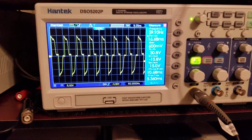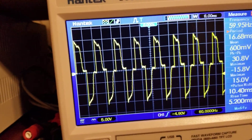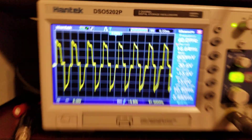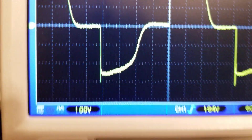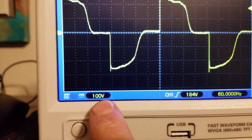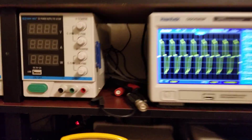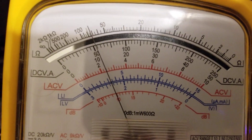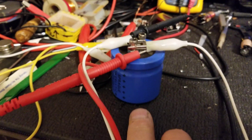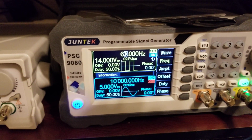This is the input on the tickler coil — the driving coil — which is right here. That's my output. On the 100 volt scale now, but we're looking at the AC side of the bridge, not the DC side. We're at 51 volts on this cap. 60 hertz, square wave — positive negative square wave.